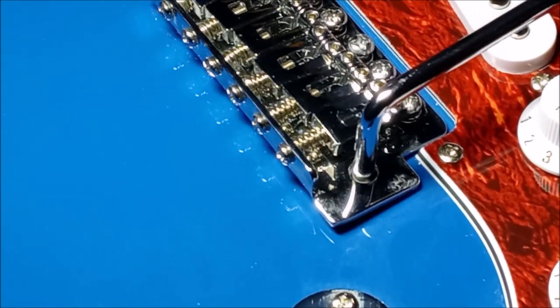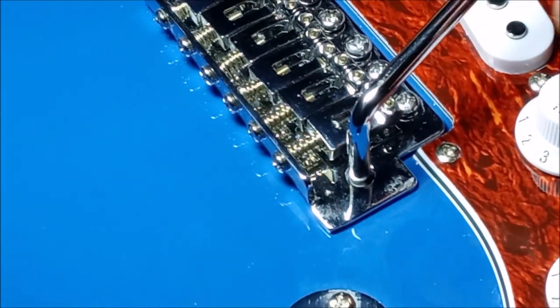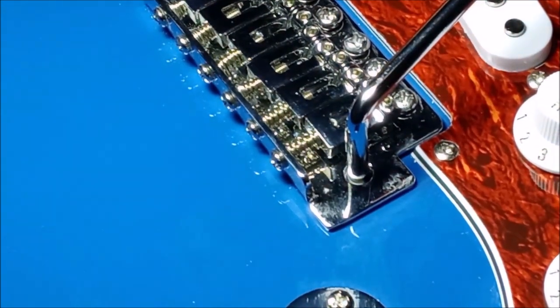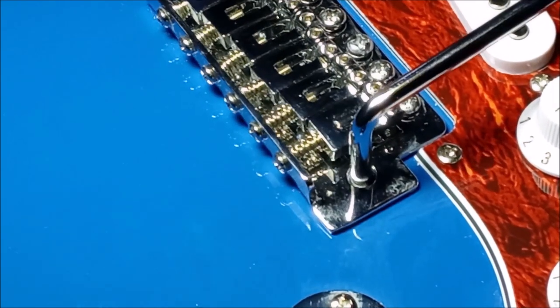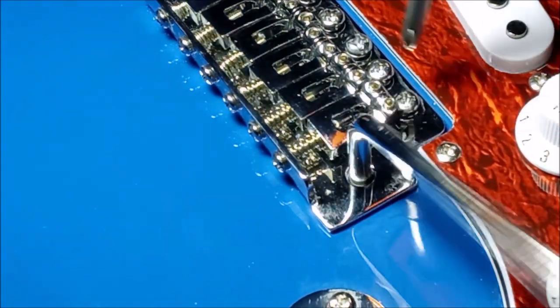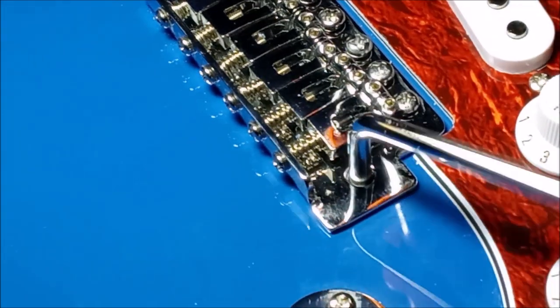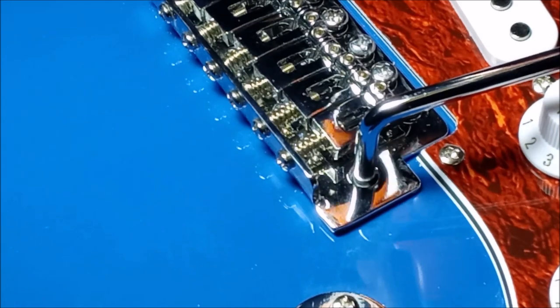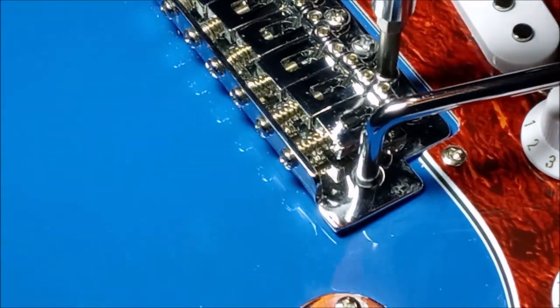Much better, much better. See, the plate is not rocking up and down. It's not lifting off the surface. That's what we like. Beautiful. Again, the ones in the middle I'm not as concerned about. This one I can see is up a little high. Lowering is not going to affect anything. And I like to make them so they all kind of match.